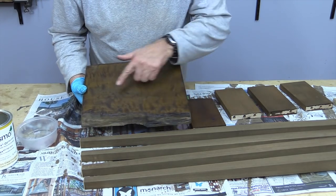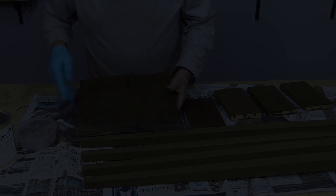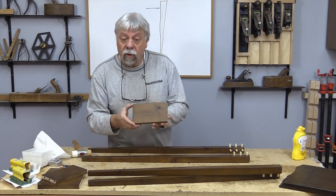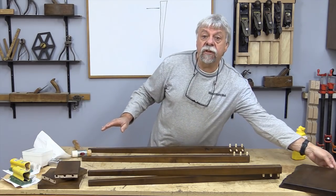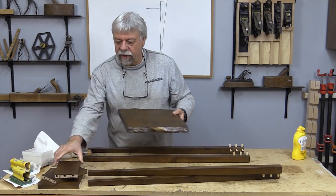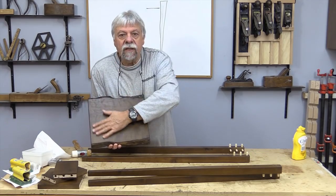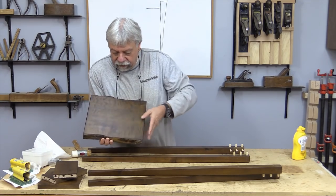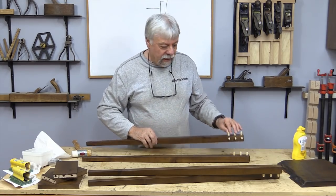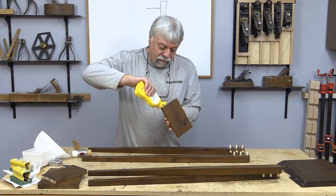There you can see some of the figure that's come up on that. I've done all of the pre-finishing and put four coats of Osmo on there, and I love the color — this is the custom dye that I mixed up a few weeks ago and it just turned out perfect. There's the top, and you can see the figure of the wood has remained. I love that. I've already put some of the dowels in here, so we're just going to go ahead now and finish doing the rest of the assembly.